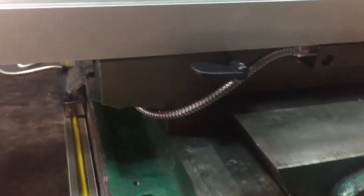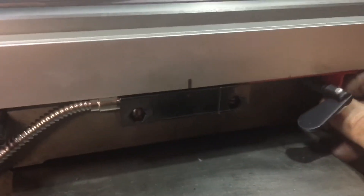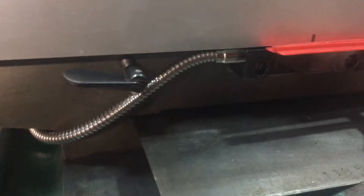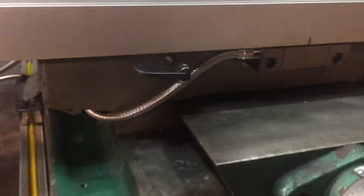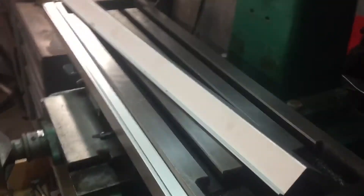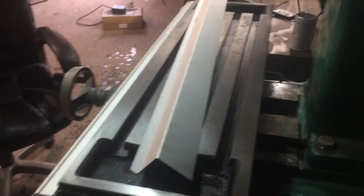When you're putting this on, it comes with this piece right here which just slides out. It's essentially like that, and you mount it, get it shimmed up, and then you should be able to slide that out nice and easy. The same thing was done on this side and everything clears, and I have full table movement.